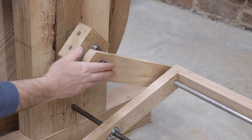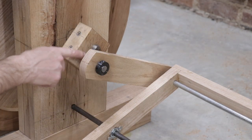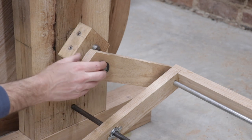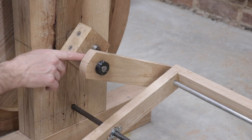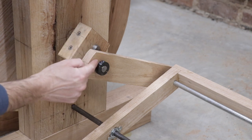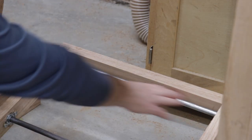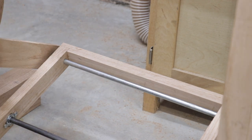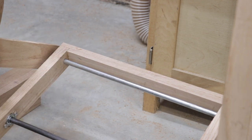The final portion of the pedal mechanism is made up of this linkage arm — I think that's probably a reasonable term for it. It attaches to the back of the pedal and also to the offset axle on the offset block. I'm using stop collars to prevent the linkage arm from sliding off. The linkage arm has a three-eighths-of-an-inch bearing pressure-fit on one end and a half-inch pressure-fit bearing on the other end.